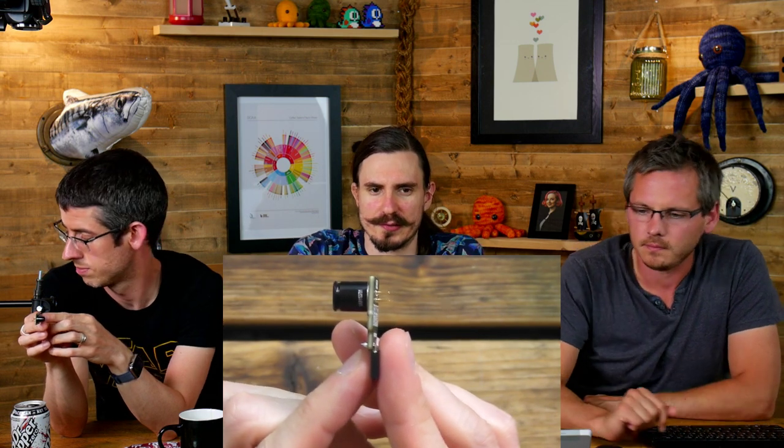Yeah, basically we've gone with those sockets because the sensors are very expensive and we didn't want to risk them in the soldering process. So we put surface mount sockets on there instead. And I guess if there was a fault on the board, you would have to discard the camera as well. Yeah, exactly. These cameras you can actually just whip off the breakout and run entirely on their own with a few bits of breadboard or something. The breakout just makes them much easier to wire onto. Yeah. Much less likely to be damaged, of course.